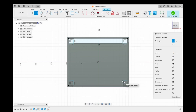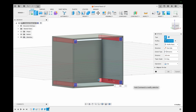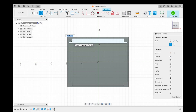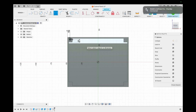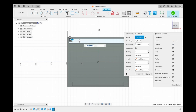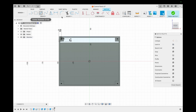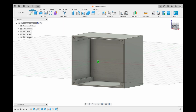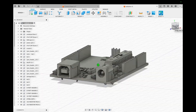On the front face we start designing four squares in four corners. These squares are then extruded in to make space for screws that will join the control panel with its lid. On these squares we start sketching holes for the screws using the pattern feature. We then extrude these sketches in to make space for the screws, and choose the inner faces of the extrusions on the base to make a consistent space for the Arduino to be kept in.